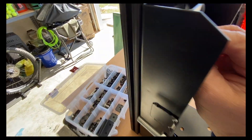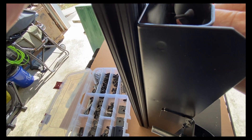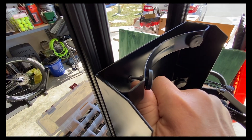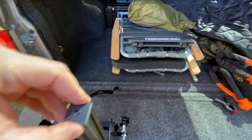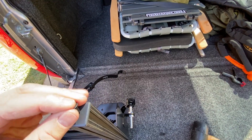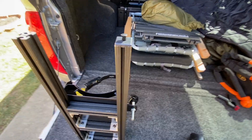Once you get all your parts together, it's really easy to assemble — basically just using an Allen wrench and some basic tools. It's real solid. I love working with 8020 because of that. As you can see, I use the 8020 inside corner brackets with T-nuts to assemble everything. It's very solid and worked out great. You can also buy end caps that go on the ends of the pieces you cut to give it a finished look — they come in the 10 series, 1020, 15 series, and so on.